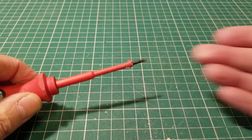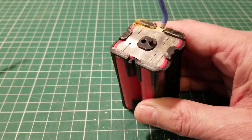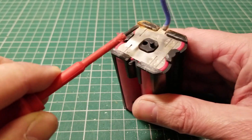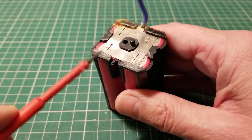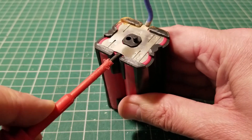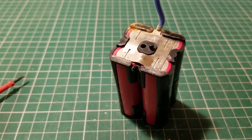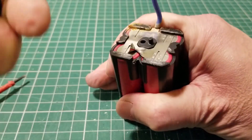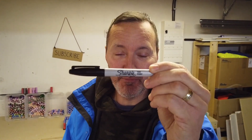Next: a proper small flat-bladed screwdriver — not a micro jeweler's one, but something around three or four millimetres. Here's a battery I made earlier — one of my hell-no batteries with nasty water damage. I use this to get started when removing the nickel strip; there's nothing to grab onto, so I use the tip of the screwdriver to just lift up the nickel, and that's enough to get my snips in and get going. Also, once you've tested your cells, you're going to need a proper Sharpie to write the capacities on them.